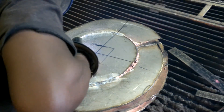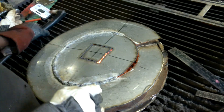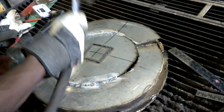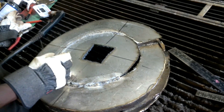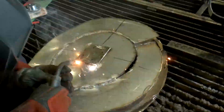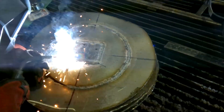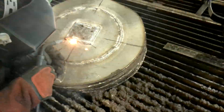Cut it out like we're in Star Wars. We got it out — now you get the idea, which was hard to explain before. Now I weld the flange onto the circular piece with solid, penetrating welds all the way around because we don't want this thing ever coming off. Even the areas with pretty large gaps I filled in completely — I didn't spare not one spot.